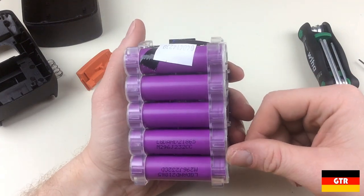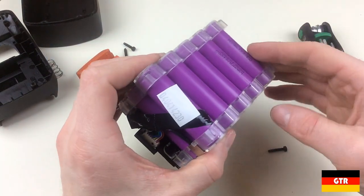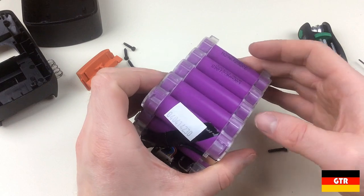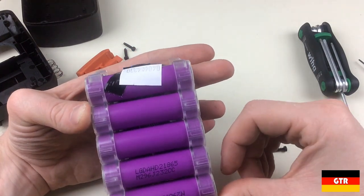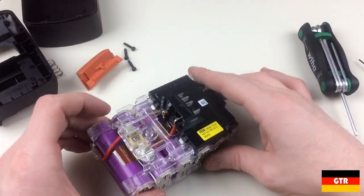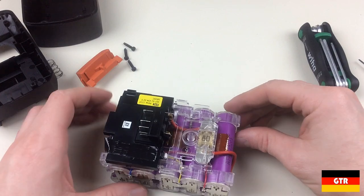I'm guessing that the only difference between their 14-volt and 18-volt tools is that 3.6-volt cell. You can see wires going to each of the individual cells for proper load balancing when charging. The charge-discharge control board is potted so there won't be anything to see there. The actual batteries are LG branded, which is a pretty respectable brand of 18650s — not quite at the level of Japanese Panasonics, but not far behind. This is definitely a well-constructed and well-designed battery pack.